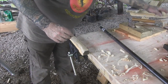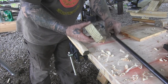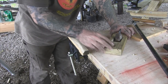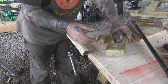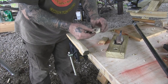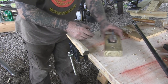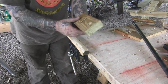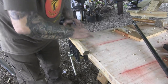I went through two or three different wedge designs. I didn't realize what a critical part of this whole thing the wedge was — you've got to keep this throat from getting blocked with shavings. I tried to V it and these things still got in the way. I tried another design and broke it off — stupid trying to use end grain. I was in a hurry and shouldn't have been. So I finally went and got a piece of hard wood, a piece of maple, cut it off, rounded it up, and now I've got this thing pretty much working the way it's supposed to.